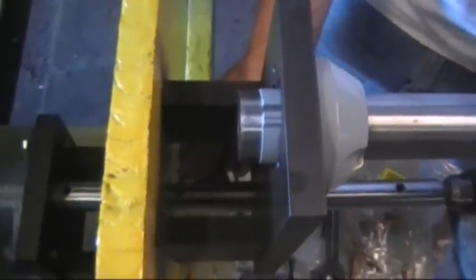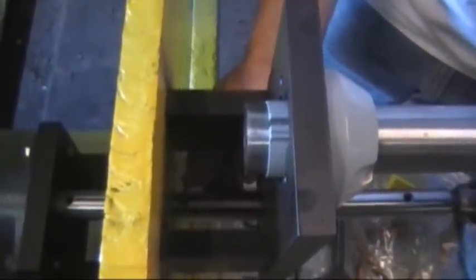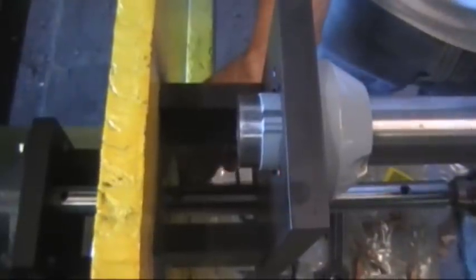Adjust the position of your carbide cutter. Don't be impatient. Don't take more than a 32nd of an inch off absolute max, preferably less.